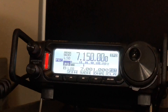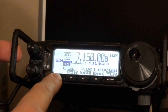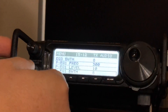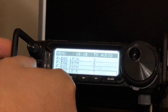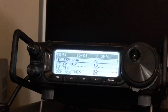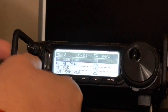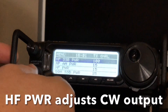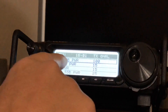Now you may be wondering well how come that's not going over to a hundred — for one thing this is not a peak reading meter, but let me show you why. I'm going to long press the function key and go into the big menu, way past the EQs. There's where you set your parametric EQ parameters without the processor, and PEQ parametric EQ parameters with the processor. And here we go — HF power. You'll notice I've got my HF power for sideband set at 25 watts because I use this radio mountaintop portable — carried in a backpack. But let me go ahead and run it all the way up to 100 for sideband. You've got separate settings for AM, and where it says HF power — that controls CW power. If you want to adjust power out on CW it's simply HF power; this is HF SSB power.